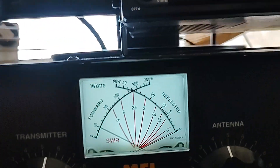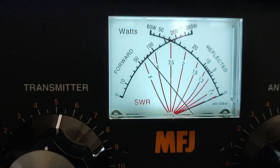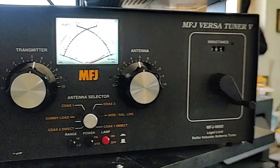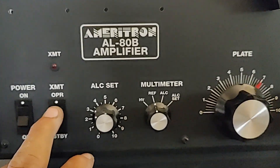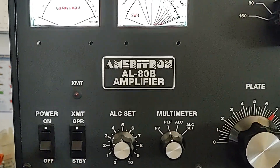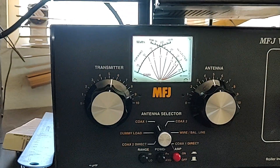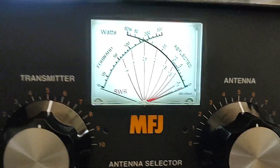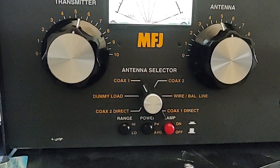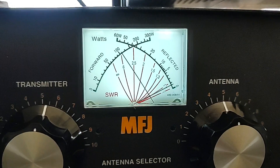Let's go back to low scale — we pushed it out of high scale already. We're pushing just about 80 watts here. Now let's see if the SWR moves. The amplifier has been tuned and it's out of standby. Let's put it back to antenna and see if the SWR meter rises. It's not moving now — it's staying steady.